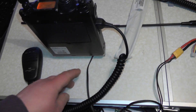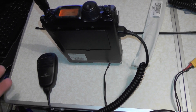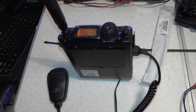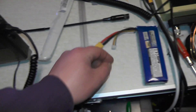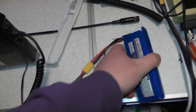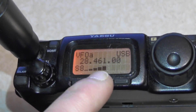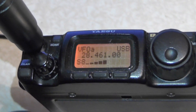I'm just using the power lead I've got with my 817. If I find another power lead at a boot sale that fits in the back, I'll just buy the power pack, chop the end off, and use the cable — 50p for the power supply, chop the connector off and put an XT60 on there. The battery I use is my usual 5Ah LiPo, though that one is looking a bit puffy. So let's check the SWR — I showed how to set that up in the previous video.